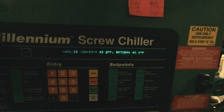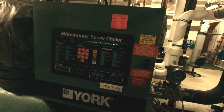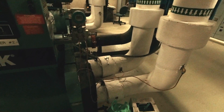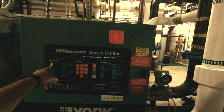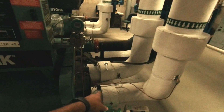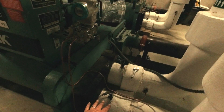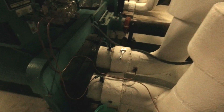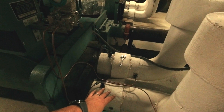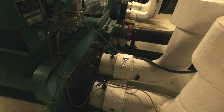That's what I wanted to see right there — 50 degrees, which is exactly what I had leaving. So what I'm going to do is tag the entering sensor as bad. This sensor here is reading several degrees cooler than it actually is. I plugged it up just as a temporary fix, and hopefully it'll be enough to let it run and come on and do its job when it needs to.